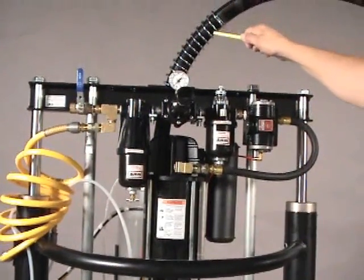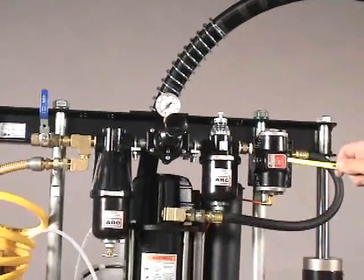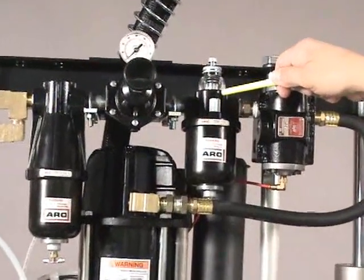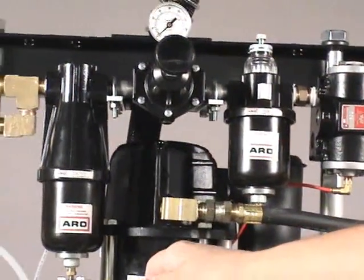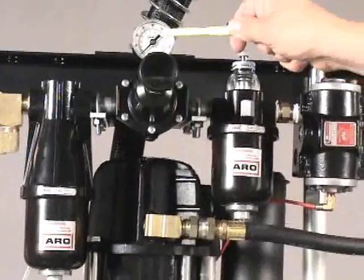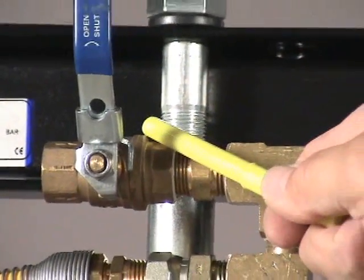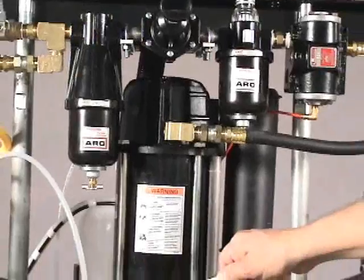The spring is a safety spring to prevent the material hoses from kinking. We have an air motor control valve and an oiler for the air motor, which uses 30-weight non-detergent oil. We have the main air water trap, which you can drain by opening this petcock. The air motor gauge and regulator control the air motor. The main air inlet has an on/off ball valve with safety relief air valve. From here down is your main pump air motor.